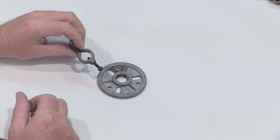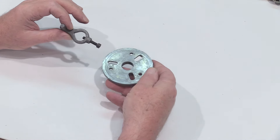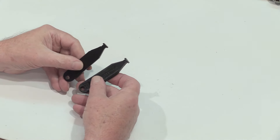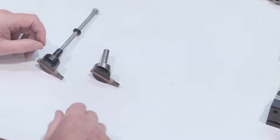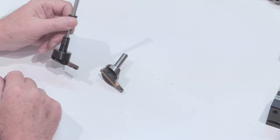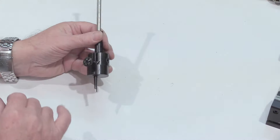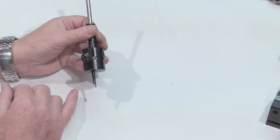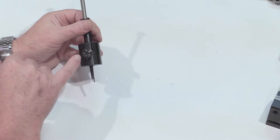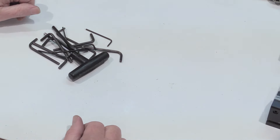This is the face plate for the lathe — it comes with a lathe dog for turning between centers. I've used the face plate for all sorts of things, like mounting fixture plates and cutting gears by super-gluing them to arbors. These little guys are for cleaning out the T-slots on both machines. I have two different fly cutters — one mounts in a collet and the other mounts in the morse taper. And I'll be supplying two unused additional cutting tools to go with these. The boring head is for cutting very precise circles; it's micro-adjustable for diameter and mounts in the morse taper of the mill spindle.